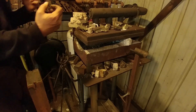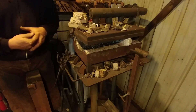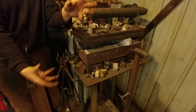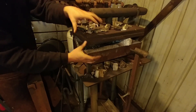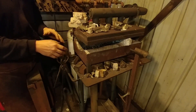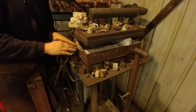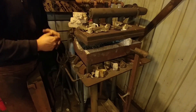I do all ornamental work, so I understand that a lot of guys want to get into blade work — which one's better for blades? In my opinion, probably a gas forge for blades. Get something with a very small heating chamber, because with blade work you're keeping it flat and pointy — there are no big loops or scrolls or odd shaped things to deal with. Get a really nice tight economical gas forge if you're aspiring to be a beginning bladesmith — it'll help you not burn up or melt tips off knife blades, and it'll help with temperature control. You can also do heat treating a lot easier in a gas forge with a knife blade.